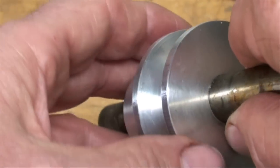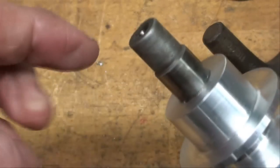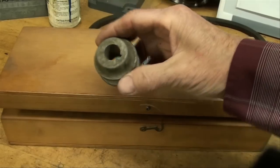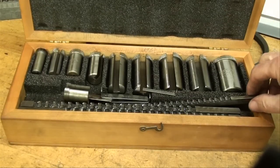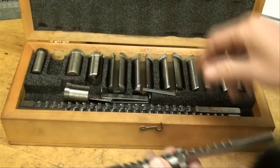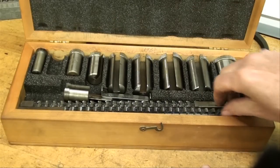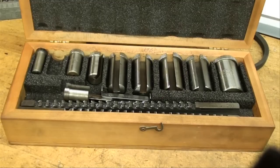My next step is to press it off, but I have to do that in another shop. Remember the plus end is the large end, so when I press it off I will be pushing from this side. My next step is to put a keyway into the pulley like you see in this pulley. Here's a set of keyway broaches in many different sizes. Out of this set I'm going to select the 3/16" wide broach, the 5/8" inch bushing that fits this broach, and we need the shim. There are also a quarter inch and a 3/8" wide broach in here.